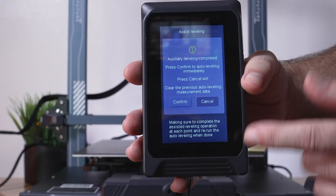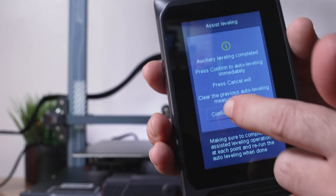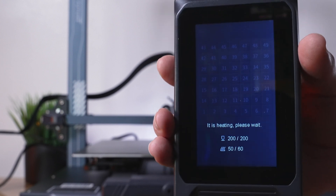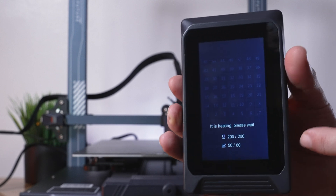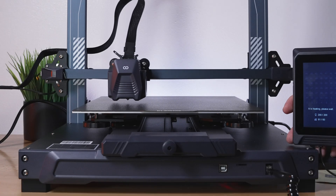You can click the same button again to go back to that step. Another reason to go around at least three times is that changing one side affects the others — quite dramatic on such a large surface. Once it all feels the same, go Home and confirm. Now it begins the auto bed leveling, taking all the probe points. It's preheating first, and then there it goes.